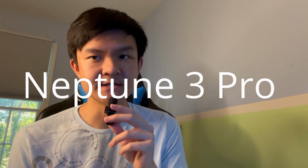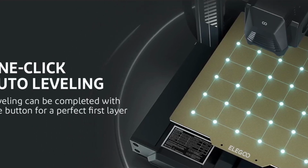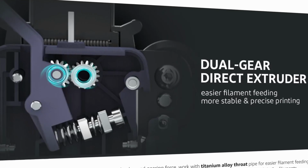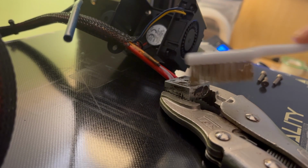My second recommendation is a little bit more expensive, coming in at $270. It has more features than the Ender 3 Pro. It has auto bed leveling, a PEI coated bed for great adhesion when printing, 2 Z-axis lead screws so you can have better stability when printing instead of just one Z-axis lead screw, a dual gear direct drive extruder for better print quality, a nice touch screen, and a partridge in a pear tree. For only about $50 more than an Ender 3 Pro, those upgrades are insanely good. I mainly got the Ender 3 Pro so that I can tinker with it, mainly because of my channel name.